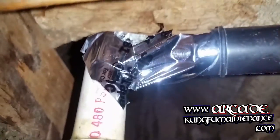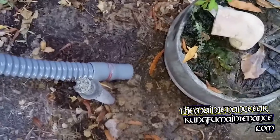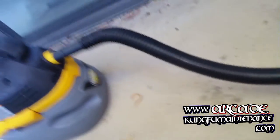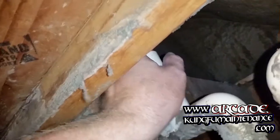What that means is the clog is further down the line. Just at the pan, you could pull it from the vent — doing what you see here. A lot of times what you can try to do is vacuum it from the vent and then plug it at the pan, so that way you're pulling it all the way back to the gravel well. But this one — that didn't work for me. I wound up pulling it at the gravel well.